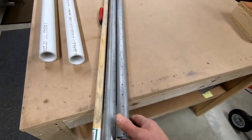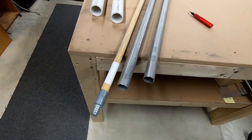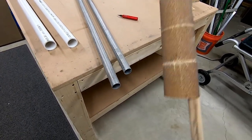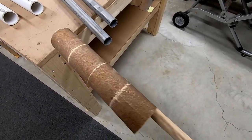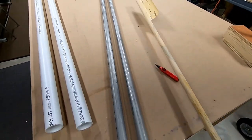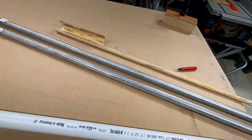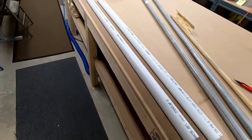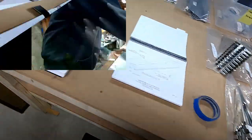I got a 10-foot pipe and I'm going to cut it at six feet and one or two inches. Then these bars — I went through with my little miniature deburring tool and did the best I could with the holes. This idea came from, I believe, the S21 Project YouTuber. I'm not exactly sure how he did it, but I stapled some sandpaper on it, rolled it up, stuck it in there and filed the rest of the shavings out. You've got to go from either end. That worked pretty good, so kudos to the S21 Project. I think we're going to line up the ribs and roll this, and that's the plan for tonight.